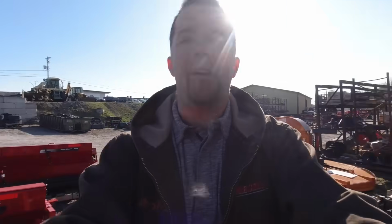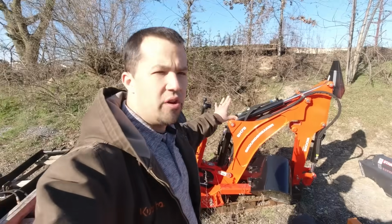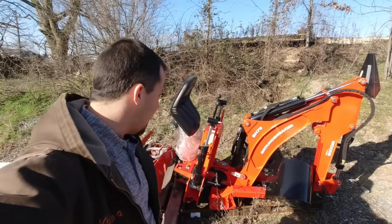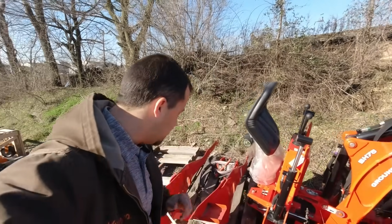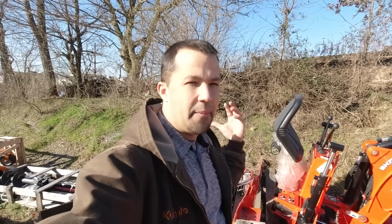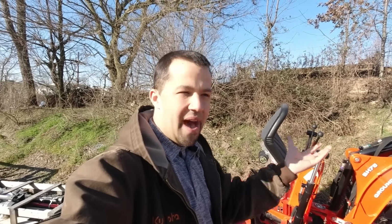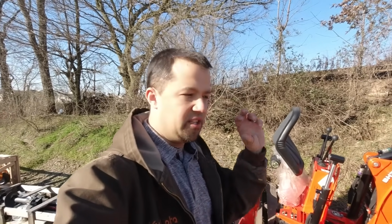When you look at the hose here, I've got a Woods Groundbreaker here that I'm beside. If you're looking for an aftermarket backhoe, bar none, these guys are the best. They have made aftermarket backhoes for a long time, and the quality of them is fantastic. There's a lot of very specific mounting stuff that has to happen between these. We've talked in other videos before about not buying 3-point hitch mounted backhoes because they can damage your 3-point and in extreme circumstances even snap tractors in half. When you don't have that 3-point hitch backhoe, you need to have a subframe, right? The proper mounting system in order to put that backhoe onto the tractor where it supports the underside of the machine and ties the backhoe much more rigidly to the tractor.